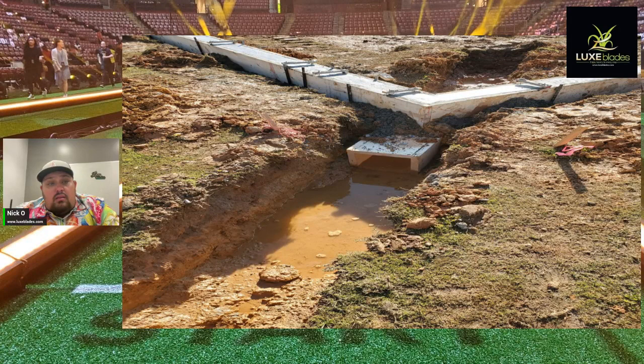The thing I want to point out is if you do sports fields, say for homes and stuff like that, you really want to have a good concrete curb. For homes, because you're not going to have a big 10-inch drain coming off, we'll put little weep holes around the perimeter. We'll cut some pieces of PVC and stick them in there before we pour the concrete. What it does is help the moisture escape the area. So that goes through the process here.